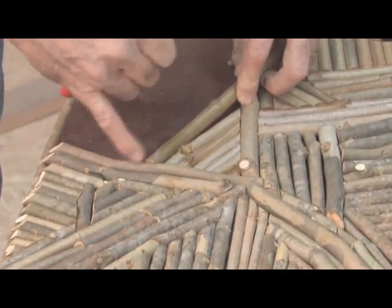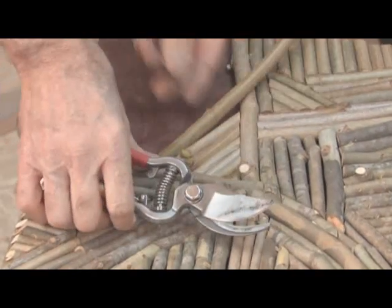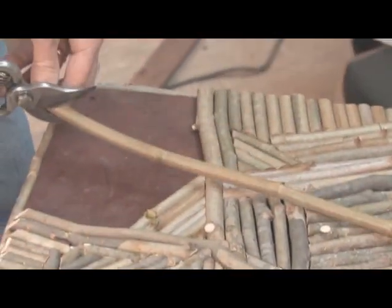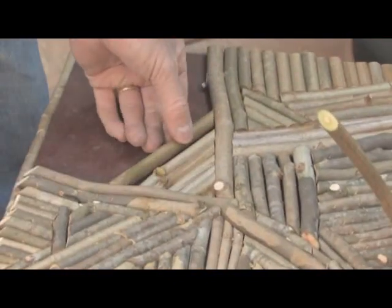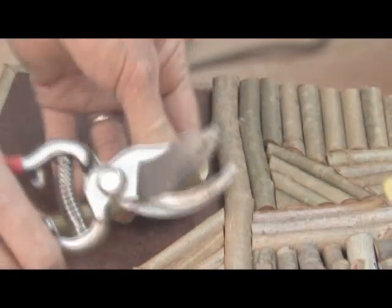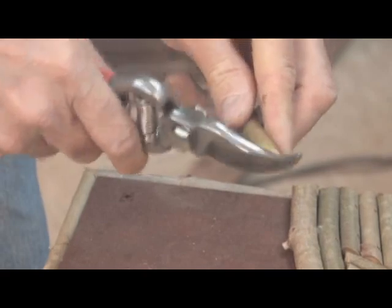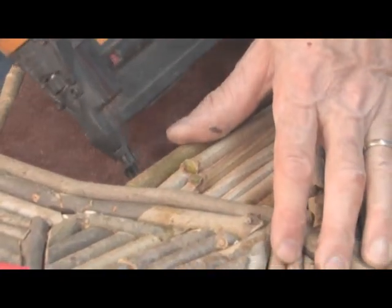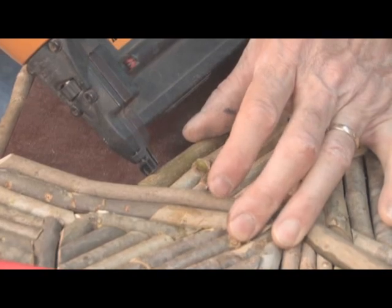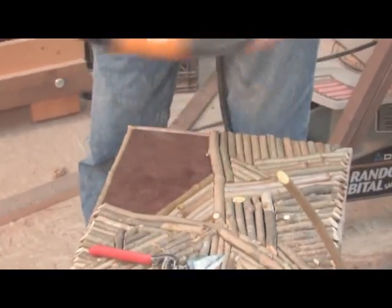The first thing I do is trim up a side so it fits, using my nippers to check. Then I check by eye to see where it's going to go. Of course I cut it too long, which is better than too short, so I recut and take just a very slight amount more. Now I'm ready to nail — I'll hold it with fingers out of the way and hold the gun at an angle so the nail won't go through to the other side. Then I'm ready for the next piece.